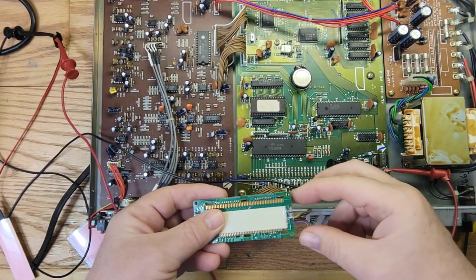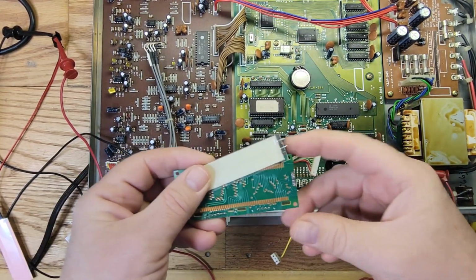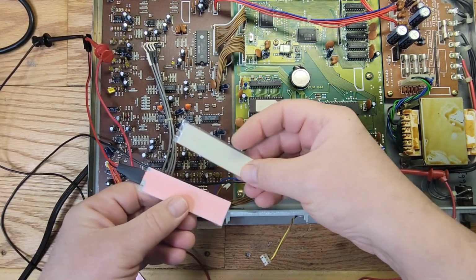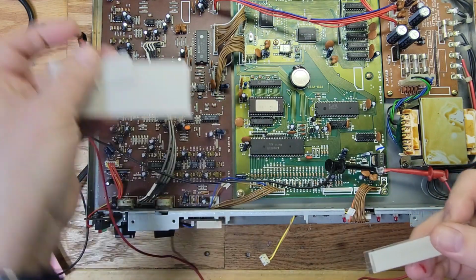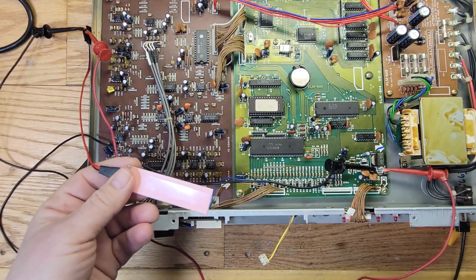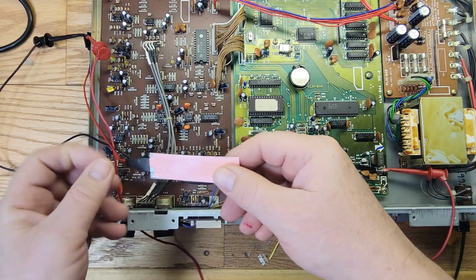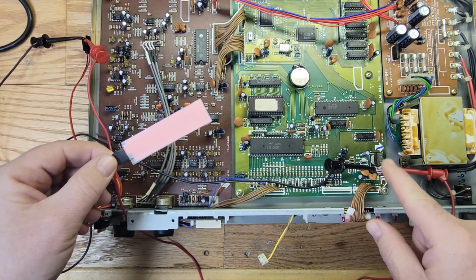All right, I've made some real progress here. I've desoldered this and took this out, put this to the side. And what I did is I cut the other panel, same size. Here is what's left over, can't be used. This is the new panel cut, and I put tape on the edges because we don't want them touching the metal, since we cut it there. Now it should be brighter, and it should have a higher voltage than 50 volts because it's smaller.